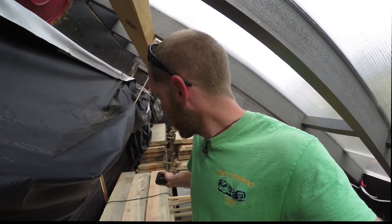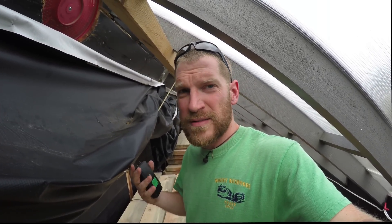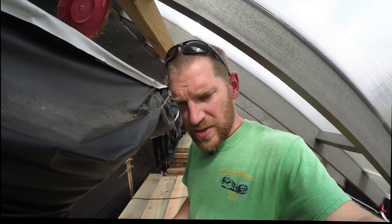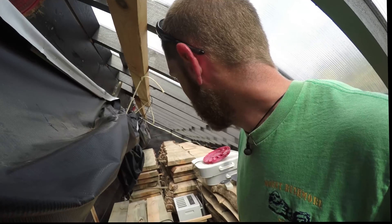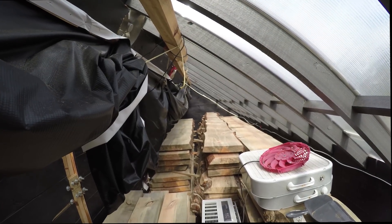A lot of people have asked me about case hardening, warping, twisting, and bowing. Because it's a solar kiln, the wood has a chance to relax overnight, so I don't see any case hardening at all and I don't get bows or twists either. I do see some loss in the wood because it's beetle kill wood — a lot of times it'll be spongy or have dry rot that doesn't show up until the wood dries and contracts. You can see it in that big three-inch slab where the checking is inside — it actually gapped and shrank a little bit, but that's easy enough to fix with a little putty.